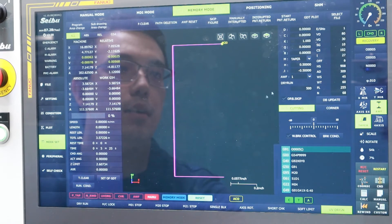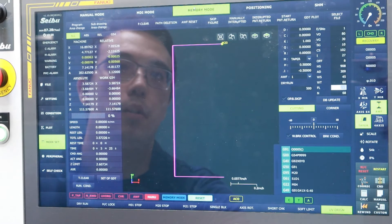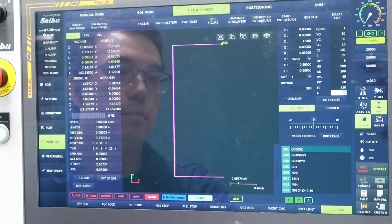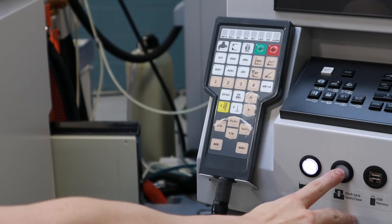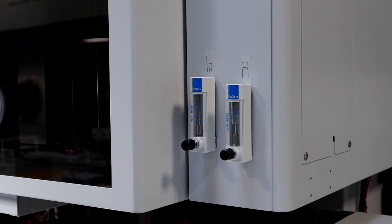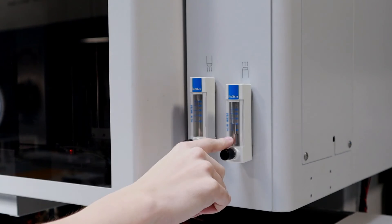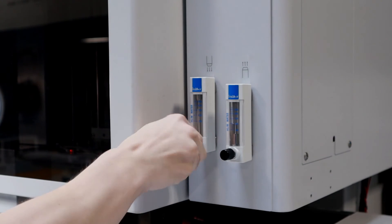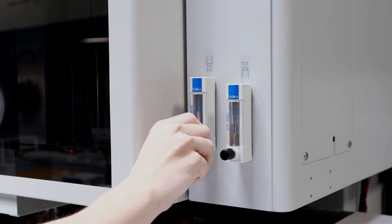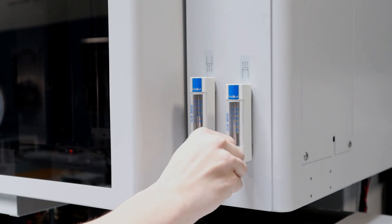Now with the SHM off, we need to adjust the flushing gauges that we set earlier in the process. Under the memory mode page, we change the FL flushing to 130. Press the input button, then press the work tank close, fill the tank, and wait for the tank to be filled. When it's full, the flushing gauges will kick on. The upper flushing will shoot straight up, but the lower flush will stay down, so we need to adjust them. The upper head flush — the top of that gauge needs to be at 1000 — and the lower head flush, the same thing, at 1000.